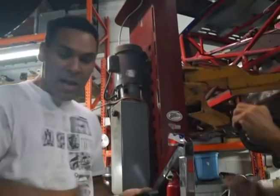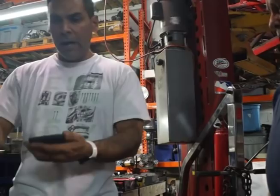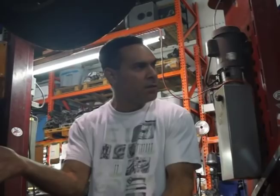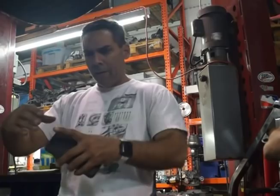The machine's like this big, and it has a left pedal and a right pedal. I need half inch by half inch. It rolls beads. You put it in there and roll a bead, it bends pipe, it has the dies, three circles, and you change them. Then you have another tightener up here, and it has a measuring, it's all digital. It's not cheap, like $5,000, but it does square, rectangular channel.